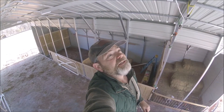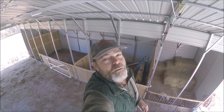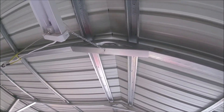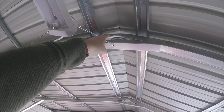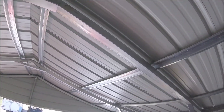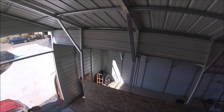Here I am up on a ladder in the barn. I've already blueprinted a little bit of what I need electrically. To give you an idea what I'm looking at — this is the peak of one of the roofs. I'm going to put a junction box right there, come out with a 45-degree run down that beam, then put in a 90 and drop into that box.